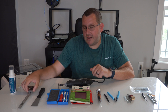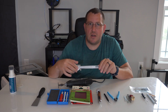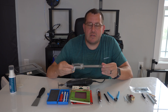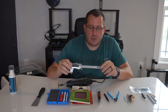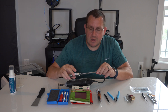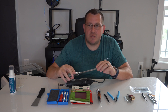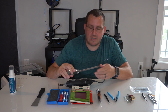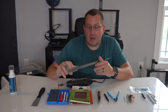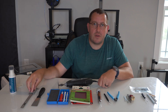The next item I consider to be a must-have is a set of digital calipers. I don't think they were much — probably like $10 or $15. It's important when you're trying to calibrate your printer because if you're using a ruler you're just not going to get proper measurements. Think about calibrating your e-steps, maybe some of the flow for your walls, or even just the overall print size if you're questioning that. I use them quite a bit and they're not expensive, and you can use them for a lot of other things too.